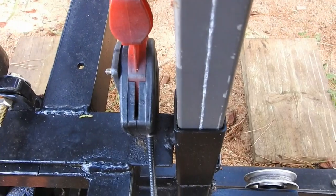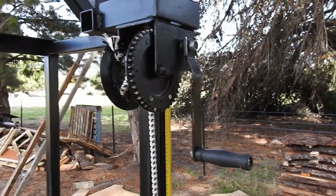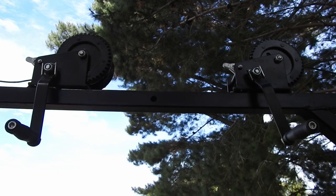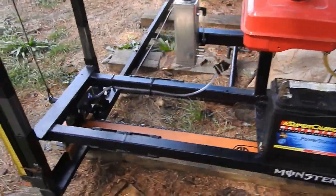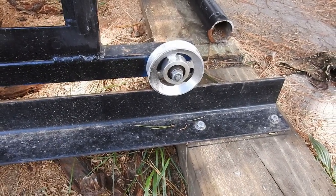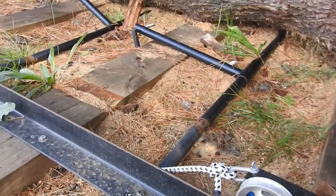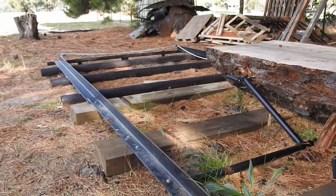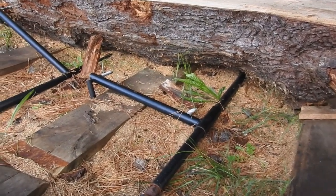There's the throttle just there. Here's the pulley to give the horizontal travel — two pulleys, one for left, one for right. I did try one pulley for the whole cage but it went rickety, so it was no good. The wheels are aluminium on bearings, on 75mm heavy-duty angle iron, mounted on sleepers which goes down there for 4.2 metres.